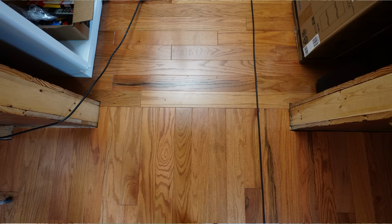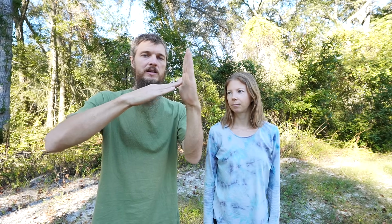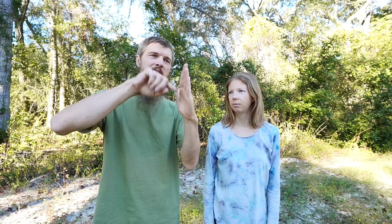And that means when we worked our way over and we hit that kitchen floor, where we had one board going this way, one going this way, they lined up perfectly, dead smooth. If we had started just along the edge of the wall and said, oh, put it along the wall, they would have been coming to that floor at an angle. And you would see maybe a little unevenness, a little gappiness. It would have looked bad. We could have gotten away with it, but it wouldn't be as clean as the finish we got. Guys, take time to get those first pieces perfect. That's what everything else relies on.